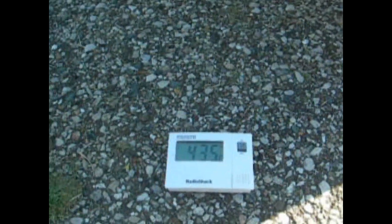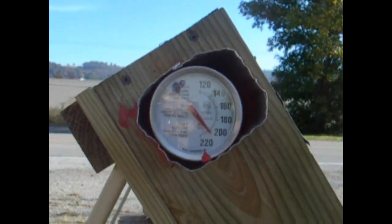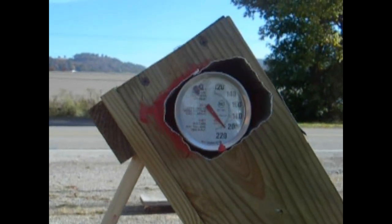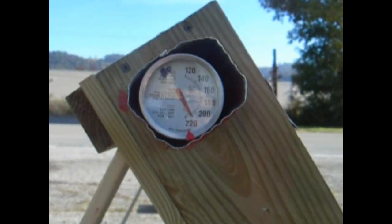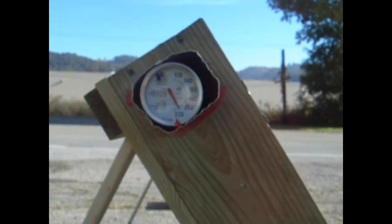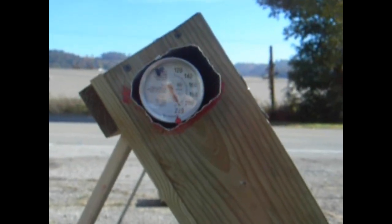It's been almost an hour. Temperature has risen — it's 43.5 outside — and my temp in my can has just topped over 200 degrees. That is so neat. I don't have the glass sealed or anything because I'm off site and I got to take it home — it's too heavy for me to carry with the glass. It's a good day to test — over 210 right now. It's been exactly one hour. You can see that it's at 210 freaking degrees. I'd say this is a good test. I think exposing your headers and everything to the sun helps a lot. This is the highest temp I've got — it's going over 210, probably 211. That is incredible.